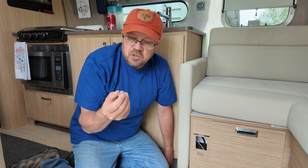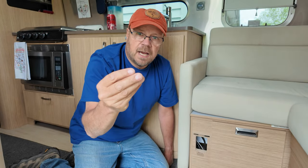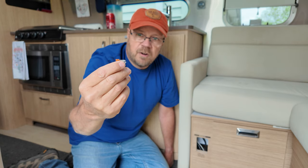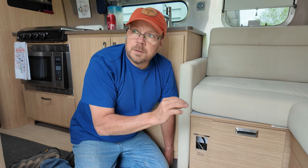They're nice because they just snap in place. You can see there's a spot for the two wires to go in and then these two yellow handles are up. When you put the wire in you just close the handle down and it secures the wire, then you can bring the other wire into the other slot and connect them and you've got a very positive connection that can be undone at any time. So the next time this propane detector needs to be replaced I'll be able to very easily go in and add a replacement in by just using this type of connector.